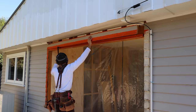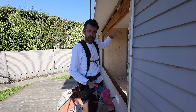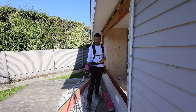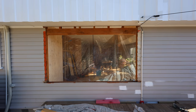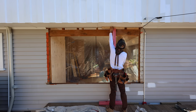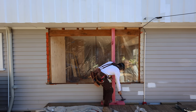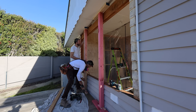So not only does the window need to be rebuilt to a different size, we're also raising the top. The problem with having a hatch this height is that by the time you have the frame and the sash and everything, you're probably going to hit your head on the open sash as it's tilted up. So we're raising the lintel, but the fun part is transferring all the roof weight that is currently sitting on the lintel so we can move it.